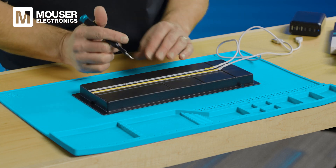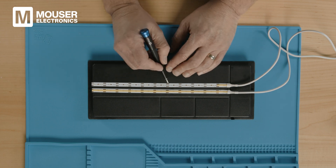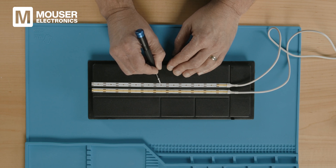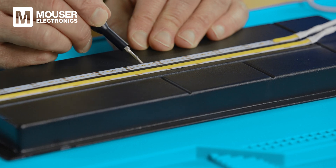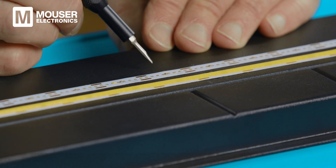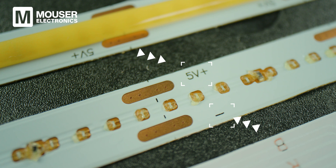Looking at this strip, we can see it's in segments, each delineated by the cut line. The copper bars tell us where we can cut the device. The 5 volts runs the length of it from the power supply, as does ground. There are a number of very tiny LEDs along with a current limiting resistor — one resistor shared across eight parallel LEDs. These LEDs are tiny: 0603 metric footprint, meaning 0.6 millimeters by 0.3 millimeters. Zooming in, the 5-volt DC signal connects to one side of the current limiting resistor, the other side fans out to the LEDs on each side, with the LEDs connected to ground on the other end. It's a really simple circuit, but for white LED strips designed for simple illumination, it works just fine.